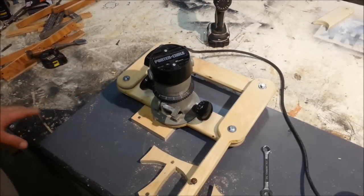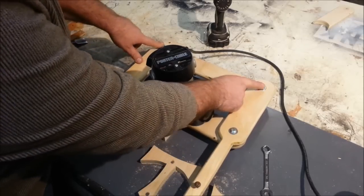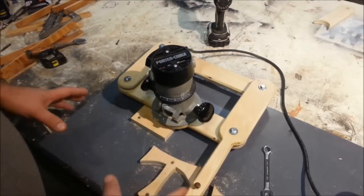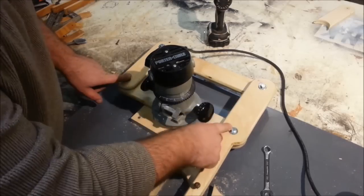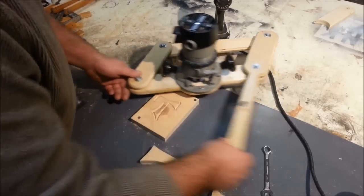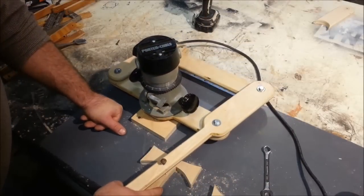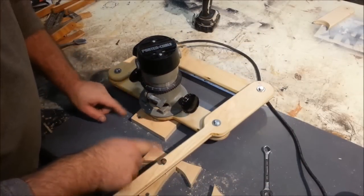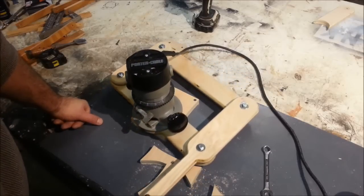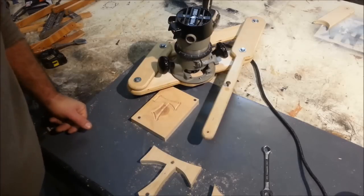What I've got here is basically the same shape we were just looking at. I based mine off a 14-inch box, so I've got 14 inches from the outside points — here to here is 14 inches, and from this point to this point is 14 inches. Half of 14 is 7 inches, so at my center point I've gone over 7 inches, and that's where my router bit sits, centered out. To carve a letter, the easiest way is to find a center point on that letter, drop your indexing pin on that, then find a center point on the piece you want to carve and put your router bit right above that — that centers everything out.